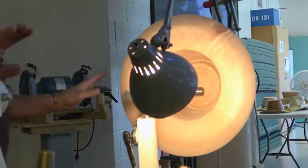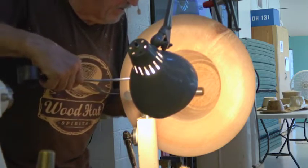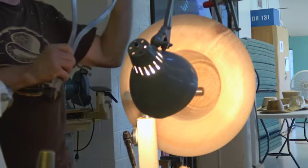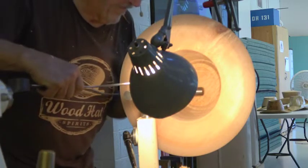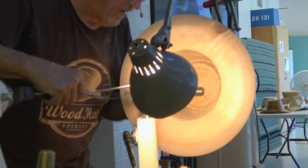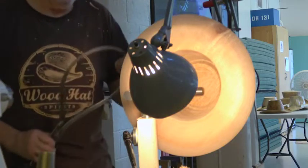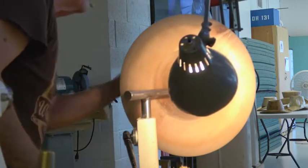For the inside, how good has it got to be, right? As long as the cut's tear-out free, and it was because of the sharp tool. See here, at the band and just above the band, a nice 3/32nds, less than 1/8, but not the 1/16th that we're putting everywhere else. Further up, I got a little loose, but then way up, I'm rubbing again, so I've got to take more up there. Here I'm good. I'm free, not rubbing right here at all. Snug up. That part is a big fat 1/16. That's what we wanted. It's just that the last inch there needs to be thinner.